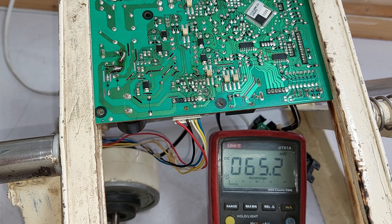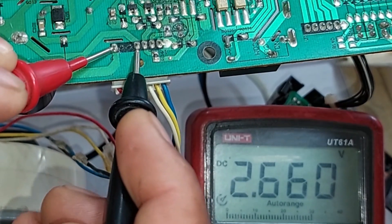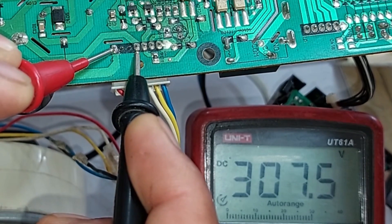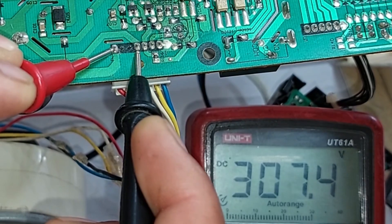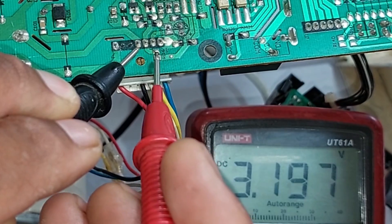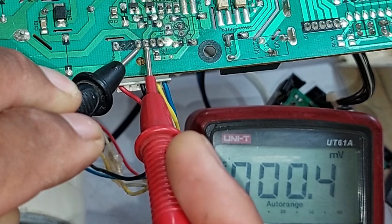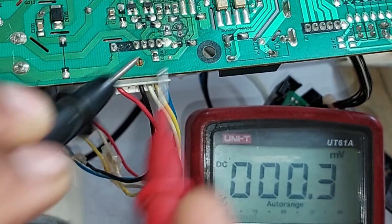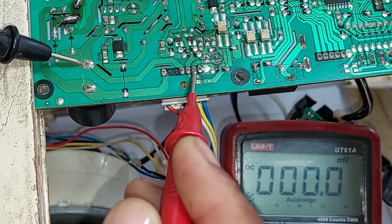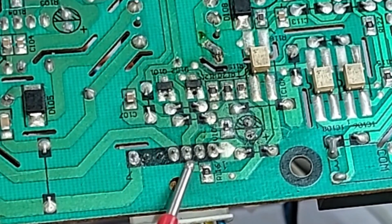The circuit board has started to operate. The first two pins should have 320 volts — 307 volts are passing through these pins. The voltage range should be 300 to 320 volts, which means it is fine. I will now check the voltages on the next pin with the black probe on the negative pin. 15 volts should be on pin number 3, but 15 volts are not present here. If 15 volts are absent, the next pin will also have no voltages — and indeed there are no voltages on the next pin as well. This means 15 volts are not passing through the transistor, or it is bad.